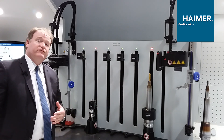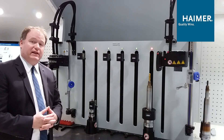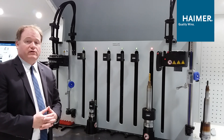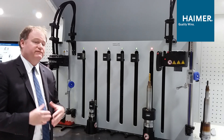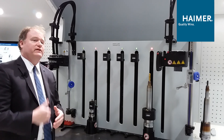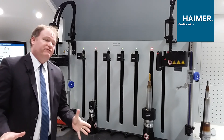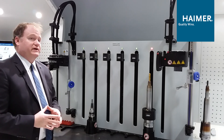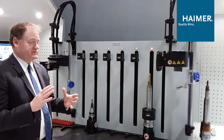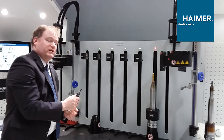The next step is to bring it over to the balancer presetter — a machine that can do balancing and presetting in one. We'll balance the tool holder assembly, then preset it, then we're ready to go. This is a real-life example of setting up a tool for a full tooling assembly offline while the machine is already running. That's really important for maximizing uptime — offline presetting means you're not wasting valuable machine time doing it on the machine itself.